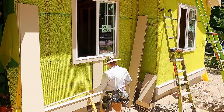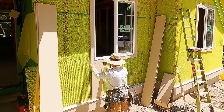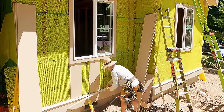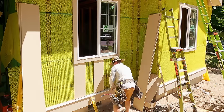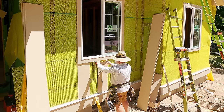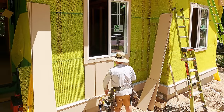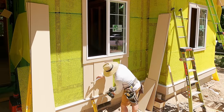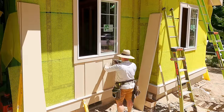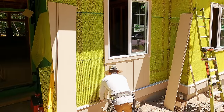This is how we always start board-on-board siding with LP Smart Side — we always center a piece on the window and work out from there. The gap between each piece — call them candy stripes — I think it was eight inches. I cut a little piece that's a one-inch rip, eight inches perfectly, and use that as a gauge so I didn't have to pull out my tape as much. The first piece goes centered, then each piece has an eight-inch gap — it's really, really simple.